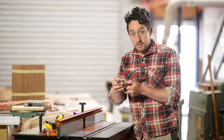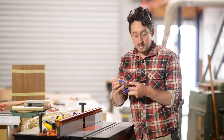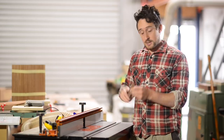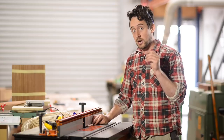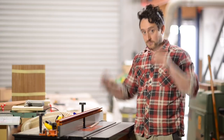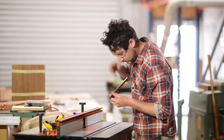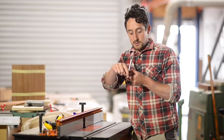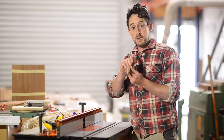To make this easier to demonstrate, I'm going to colour this face with a permanent marker — it'll make it a bit easier to see what material has been removed and what remains. These are still my test cuts. At this stage I'm just setting the height first. Once the height is exactly in the center of this piece then I'll adjust the depth of the fence. I can see the router bit needs to go up a tiny bit — there's more material left on the top edge than on the bottom — so I'll just bring that up a little bit and try again, and then we should be able to set the depth of the fence.